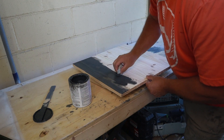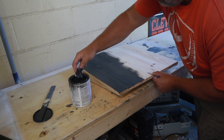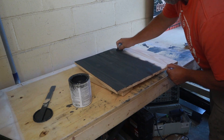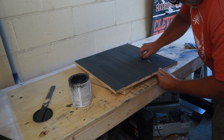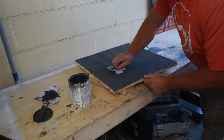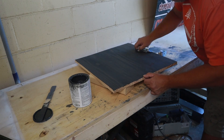I'm putting a stain on right now, and I decided to use carbon gray. I thought it would look good — I needed something that contrasts well with the pine, because we're going to cut through the stain and reveal the unstained wood underneath, and that's going to create the contrast to make this sign actually readable.